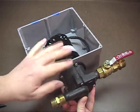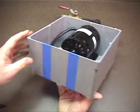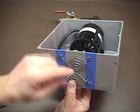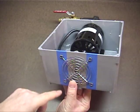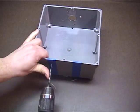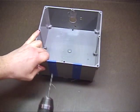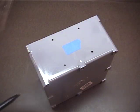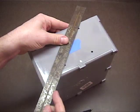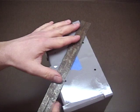Here's what it looks like with the pump installed. This will have to be removed for the next step, which is marking the five holes for the fan — four holes for mounting the fan, which you can mark using the grill, and one in the center for the fan output. Then using a straight edge you can connect the dots, find the center, and drill a hole there.